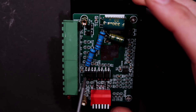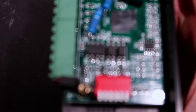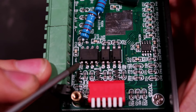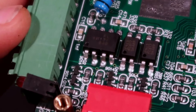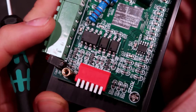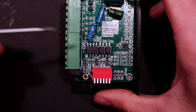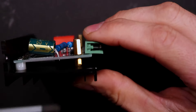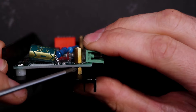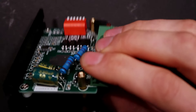After a little googling: these are optocouplers, and this is also an optocoupler — I have no idea why they're using different ones. Even more interesting, two pins on one of them are not only not connected, they don't even have a pad on the PCB, so they're just floating there. I've never seen that before — usually you still solder a not-connected pin down to a pad. There are three optocouplers total: one for enable, one for direction, one for pulse. Also, this little standoff that's supposed to hold the PCB is not screwed in all the way, and the PCB is just kind of hanging out.